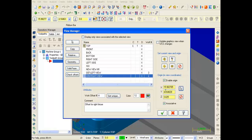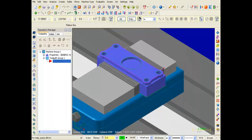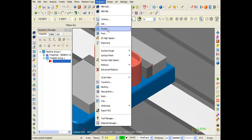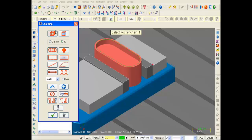Now we're going to create the pocket toolpath for the left setup — that's the G57 Left View. I'm going to click on G57, slide over to the right, and in the tool plane column pick that column to activate this view as the tool plane. I'll click OK and zoom in to the pocket. Moving into Toolpaths and selecting Pocket, I'll accept the name WCS Part 4. I'm prompted to select Pocket Chain 1. I'm going to select this line as the first entity in the chain — it successfully captured all the entities around that pocket. I'll click OK.